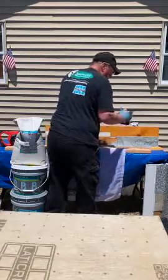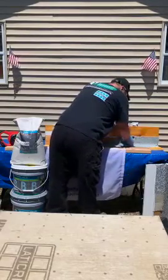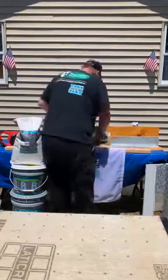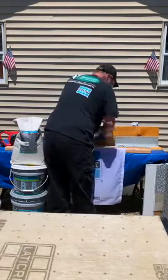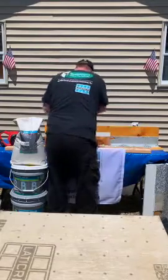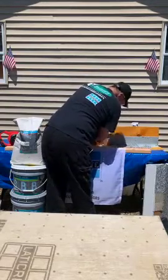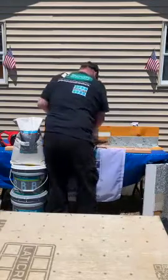And when you start working your cove trowel, what you want to do is just make sure you put it in tight and pull it straight across. And what that'll do is it'll give you that nice even cove piece across there. If you happen to see a spot that's missed, it's not a problem to go back, reapply a little bit more, because whatever you don't use, you're just going to move on down the line. You can say I got a little piece up here, you want to pull that up a little bit up there. Go back again with your trowel.